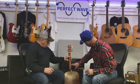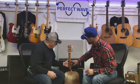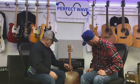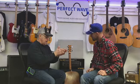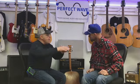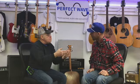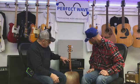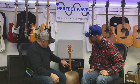So is this a 3-piece neck or is this a skunk stripe? That is a 3-piece neck. We take a piece of mahogany, Honduras mahogany, a board, you split it in half, and then you glue them together. This piece wants to warp that way, this piece wants to warp that way. It's called equal opposite grain. So it keeps its structure. Then that's glued in there with this piece, and of course the truss rod lays in on top of that.